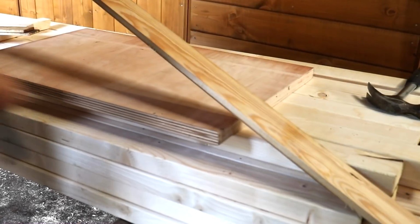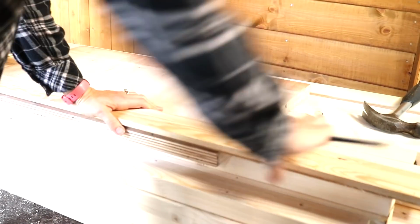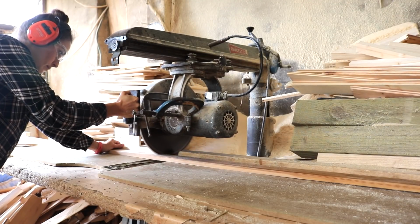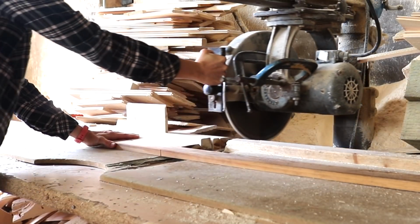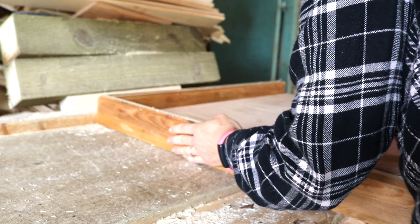So we'll start with an offcut of birch plywood, which will be the table's main platform. And I'm marking the longest length of it on a ripped down Renegade strip of skirting board that I found. As usual, I'll leave a free set of plans and links to things I'm using below. And I cut 2 of those lengths on the crosscut saw, but hand saws, if more accessible, are absolutely fine. Then place them behind the platform piece, pushed all 3 against a flat edge, then I can work out the length of my next 2 side pieces.